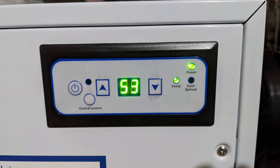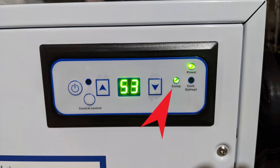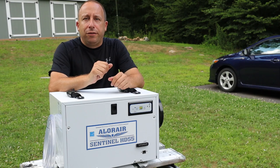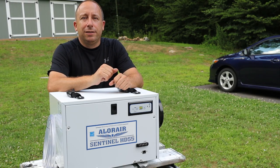There are several indicator lights on the control panel. When the power light is green, the unit is on and ready. When the defrost light is green, the dehumidifier is in continuous operation mode; when it's red, the unit is in defrost mode and defrosting the evaporator coils. If the compressor light is red, the compressor is warming up; when it switches to green, the compressor is running in normal operation. If you want to learn more, check the links in the description below, and if you enjoyed the video please give it a thumbs up.